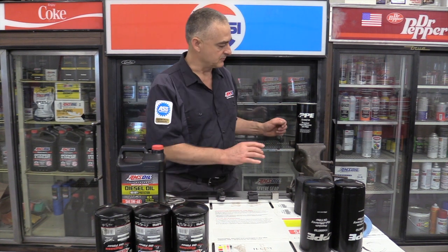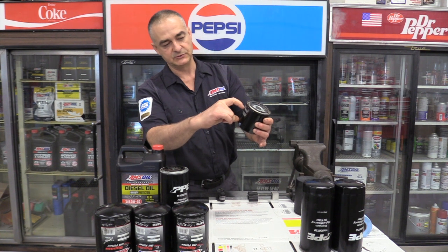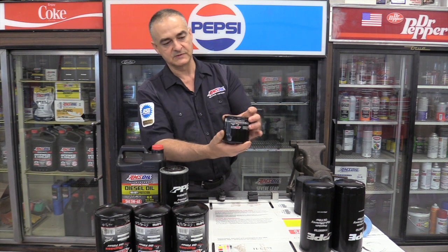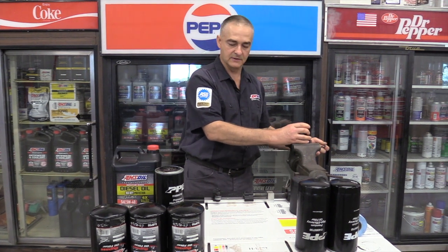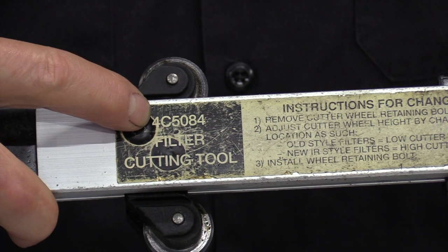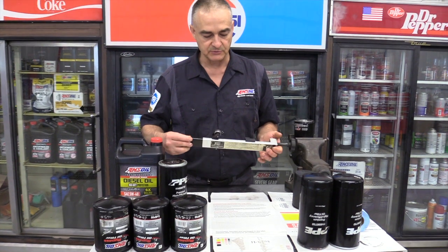The first thing we're going to do is cut apart that small filter. This filter really only has maybe about two inches worth of filter media around it — it's not a lot. This is one I took off of a Ford engine actually; Ford uses that same filter. This filter cutter I've had for about 30 years. The part number on it is 4C5084 Caterpillar. I don't know if they still make it, but it's been a very good filter cutter. It'll do the big filters as well as the small ones. It's got a little cutter head and rollers.